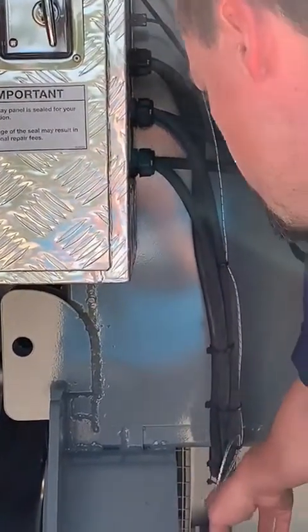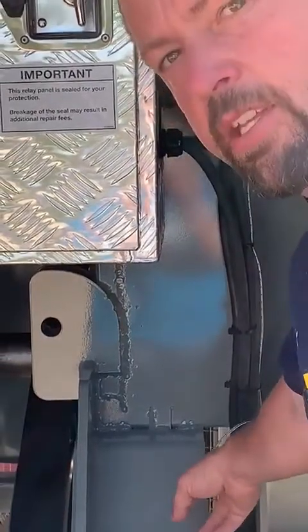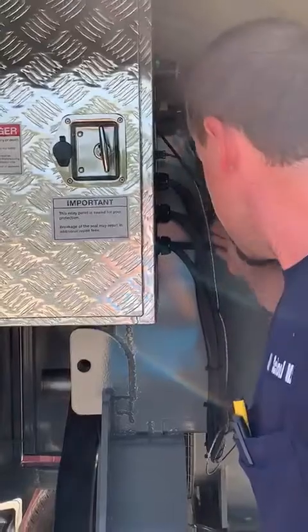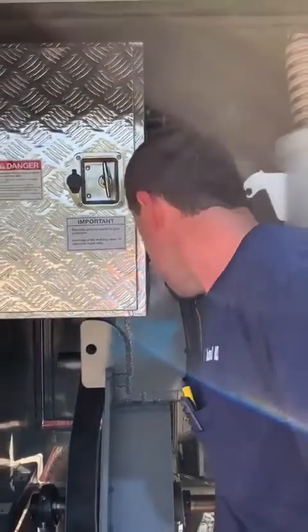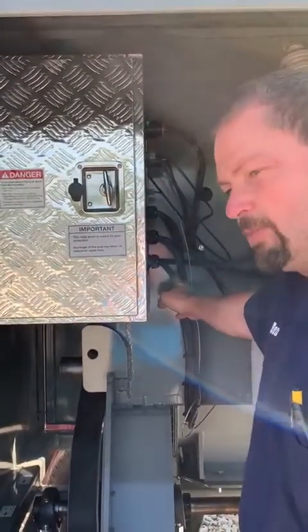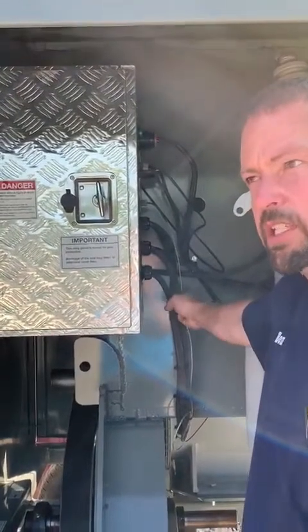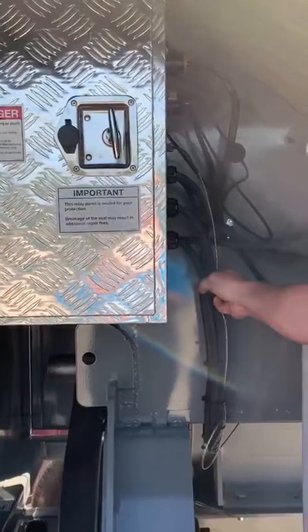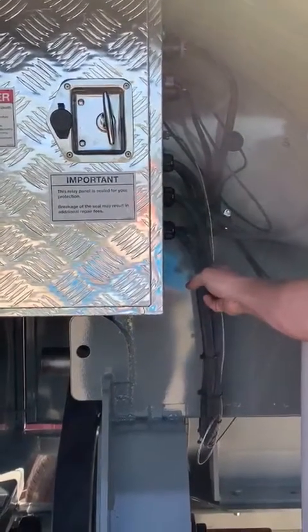And we would make sure that that thermocouple is not pushed up against steel. It is not run through a clamp. And it is zip tied securely to one of these large black cables. It seems that whenever these become shorted up against steel, we can get some false readings, and that can cause an inaccurate reading on our monitor and an irritant for our customer.